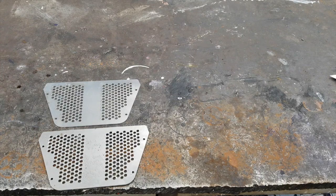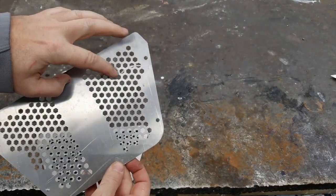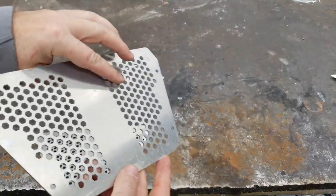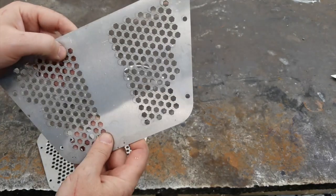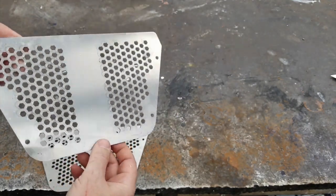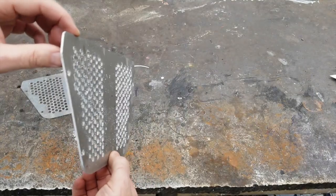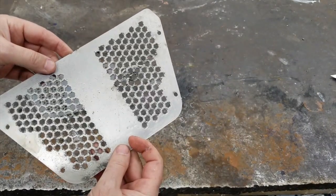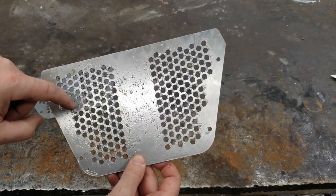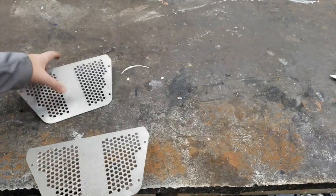Here's the comparison of laser versus plasma on this aluminum — and that's right off the laser backside. I think I can tweak these settings just a little bit; there's a tiny raised area. I did not do a lead-in on any of this, so you can barely see the pierce on each one — I probably should run a lead-in when I do these as a production run. Here's the plasma. There are no book specs for this particular combination — fine cut consumables, 90-thousandths-thick aluminum, 3/32nd — but I have good luck with this setup at 170 inches a minute. The outside cut was 175 inches a minute.